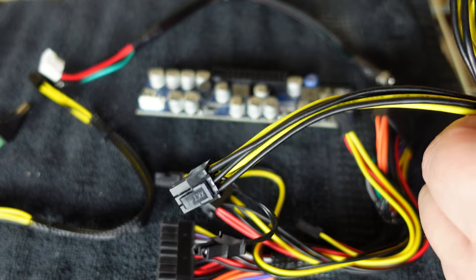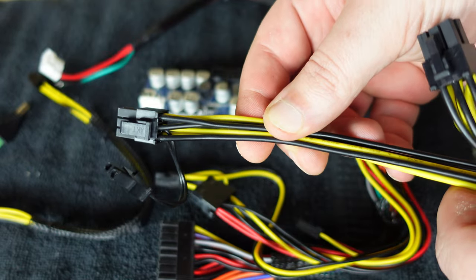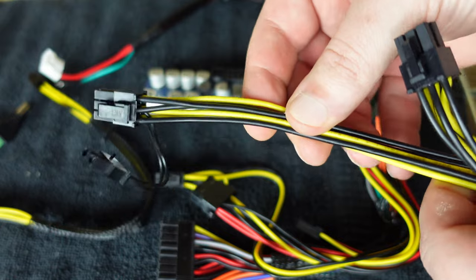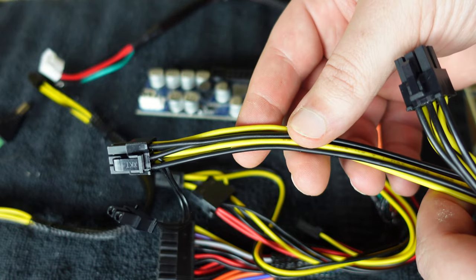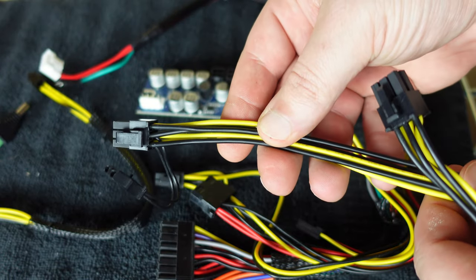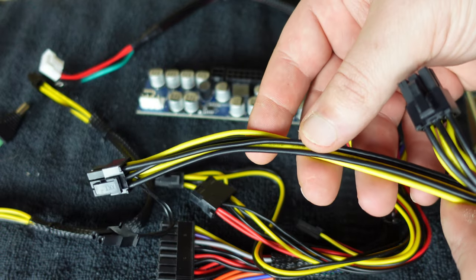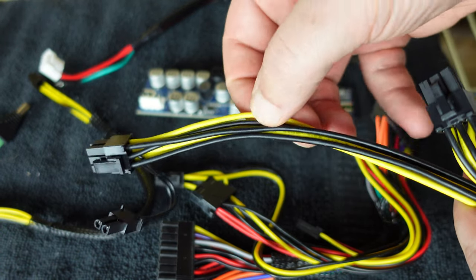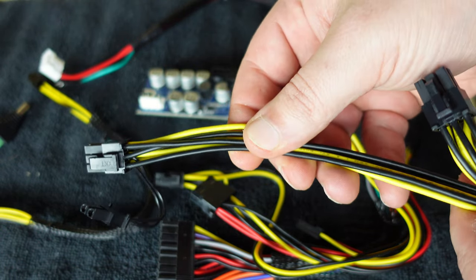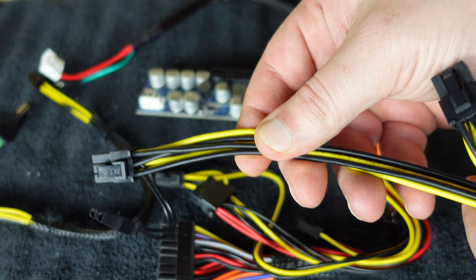The one I'm getting in for everything will be 14 gauge. I'll have a link to a calculator in the description, but at two feet this 16 gauge will be good for up to 20 amps at 12 volts — so that's 240 watts total. Keep that in mind. The calculator will factor in gauge, length, and everything else that affects how much power you can run through the wire. In the end I'm going to have a different breakout board and use 14 gauge when we do the final video putting everything together.